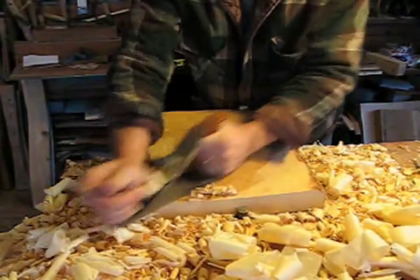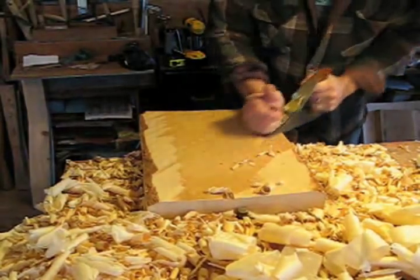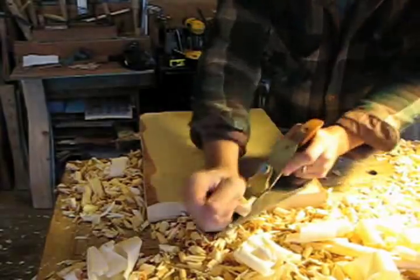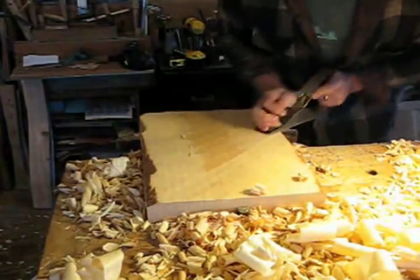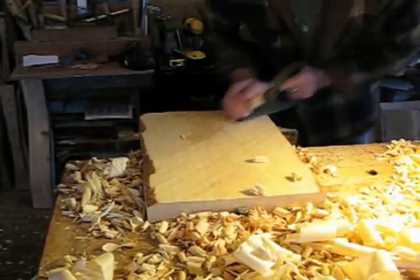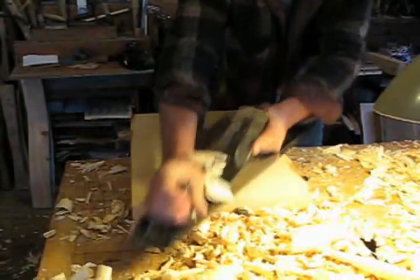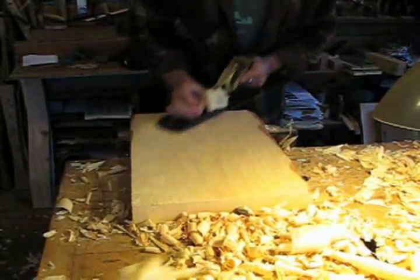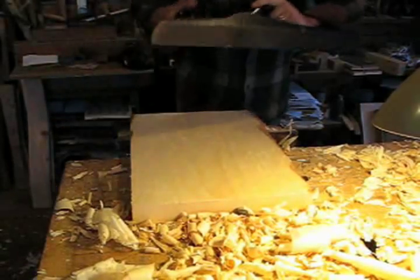And this time, as opposed to the 2 straight edges, I've got that reference mark on the edge of the boards to guide me. Makes it pretty easy. You can see I'm just now getting to the point where it's going to take a full width stroke all the way across there. And once that's done, just like before, I'm going to finish it off with a much finer tool that can also take in a lot more information, which is my number 7 joiner.